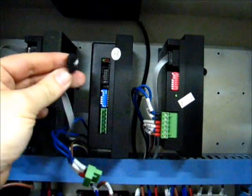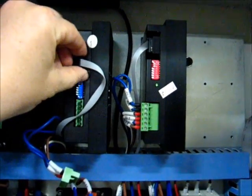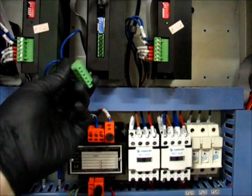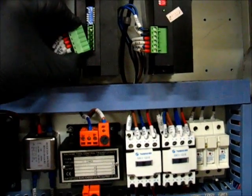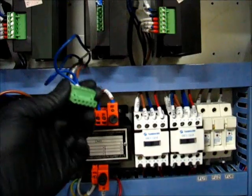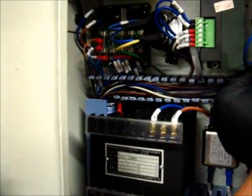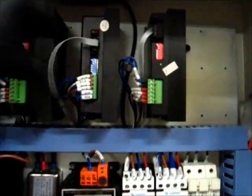The dip switch settings have been changed. Let me hook the ribbon cable up now — the notch is there and it's over here, so it goes opposite of what I was thinking the first time. It needs to be seated. The stepper driver is installed and the ribbon cable is connected. I noticed an unexpected problem: I can't turn the plug because there's not enough wire sticking out of the plastic loom. I got the loom cover off and found that a light tug on the wires gave me a little bit more room, and I was able to hook it up.